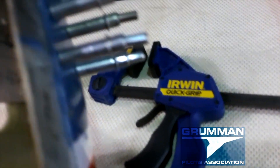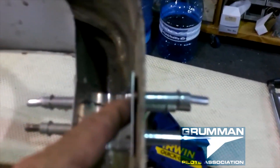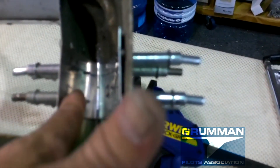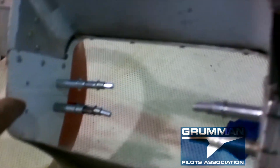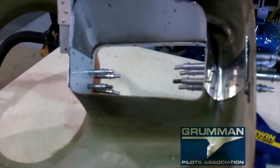We've now got all our pieces drilled, so we know where everything goes — everything's all match drilled. Now we can take all the metal pieces out and begin the process of adding the fasteners to the back on top — the screws we're going to remove — getting these set up for the blind lock nuts on the bottom. We'll do that all the way around, get everything set up, then take a break, have some lunch, and actually do the cuts after we check our lines one more time.